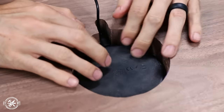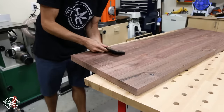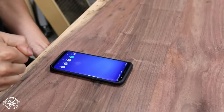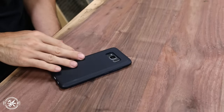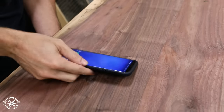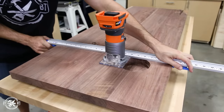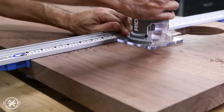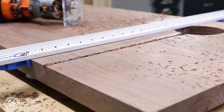For the final pass I used an eighth-of-an-inch piece of scrap to position the bit. I tested the charger through this material and it still charged, so I figured that depth would be good. After I was done I couldn't wait to test it — put the charger into the slot, flipped the top over, and it worked even with my phone case on. I'll link the charger down below. To give the USB cable a sleek exit, I cut a trench using my palm router and a quarter-inch bit, making one shallow pass straight back to the edge of the top.